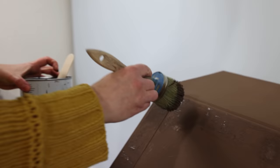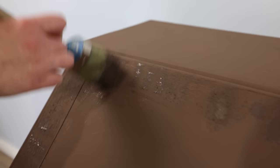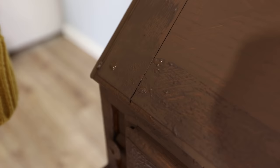What a blow dryer is doing is allowing you to create a more aggressive texture than just tapping. So when you start and you apply too much, you can just tap it if you don't like how it looks. You just have to play with it. And really, you will see what this texture is going to do later on when I apply the second coat. If you apply too much texture and you later on decide that you don't like it, you can simply sand it.